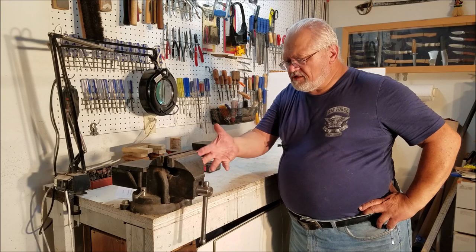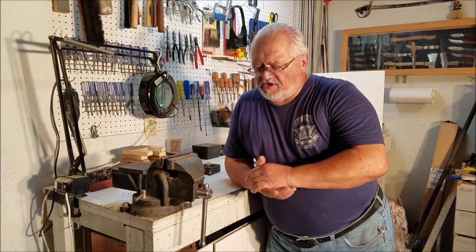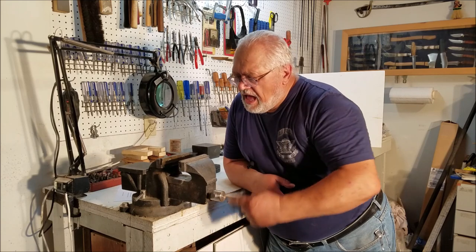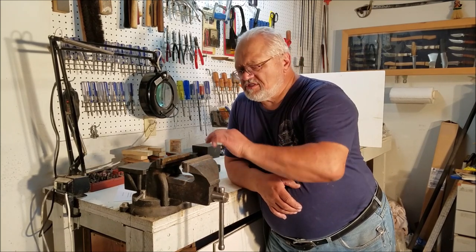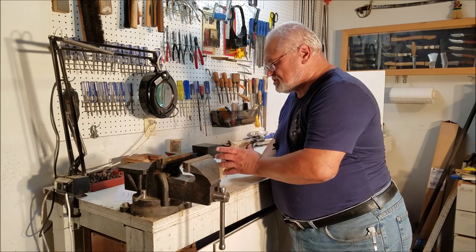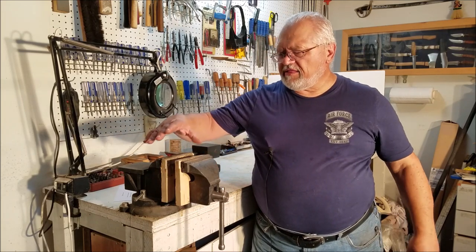The second thing to talk about — the white elephant in the room — would be the bench vise. A vise is a tool you almost cannot do without, and you may already have one. About a four-inch heavy-duty vise is what you want. I got this one from Harbor Freight. The first thing I did was reverse the serrated jaws so I have smooth steel jaws on the vise, so I can hold things without putting the serration pattern into them. The next thing you do with the vise is make some soft jaws — they'll hold things like rifle barrels without marring them at all.